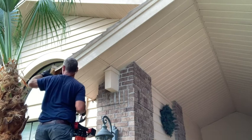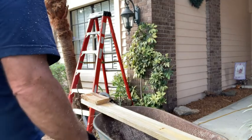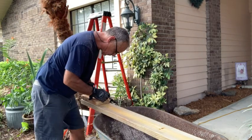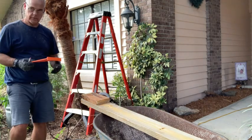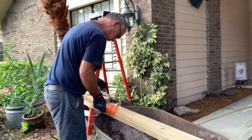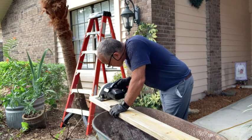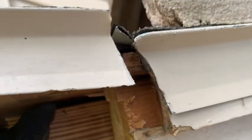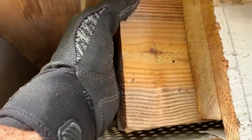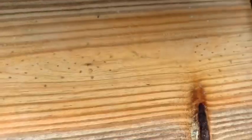There we go, done - good wood in here now. Alright guys, we've got to cut some wood and replace that rotted wood we cut out. We want to cut it a little bit longer. There we go - we cut the rotten spot out. This short one we're going to put up behind that two by six so we have something to nail to. We'll put that one there, and this one cut to the same length goes right there, and then we'll nail our fascia board onto that.